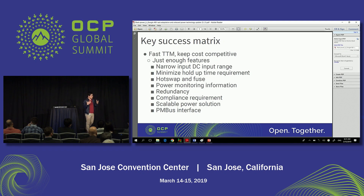On the DC side, we have a good understanding of the requirements. We want to make sure we have enough features for a cost-effective solution and a faster time-to-market approach. We're talking about defining the DC input range, what redundancy looks like — since in the DC distribution system we already have N+1 at the rack level, we may only need N+0 redundancy on the tray. These are features we are going to contribute as a spec to OCP this year.